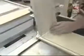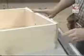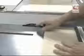Now there's the dado in the side piece to receive the back. Now notice the front of the drawer. It's an overlay drawer front, which means it has a rabbet on each end and across the top. So what I've done is installed my sacrificial fence, which covers part of the blade so that I can make that rabbet.